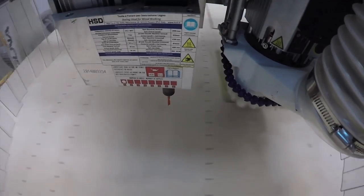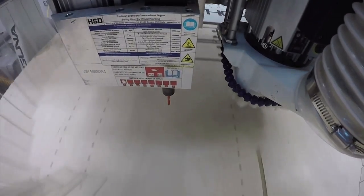Let's talk about what that performance really is. You look at speed in two ways: rapid speeds — how fast the machine moves above the material — and cutting speed when you're actually cutting wood with a router bit. Rapid speed is technically a small percentage of overall machining time; we set the SmartShop 3 to rapid at 2,500 inches per minute. The real speed is cutting speed. On our first demonstration we cut a nest of closet parts, which gave you an opportunity to see how quick the machine moved as it drilled and how fast it was in and out of corners.